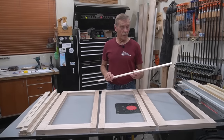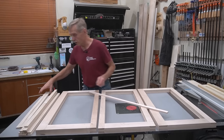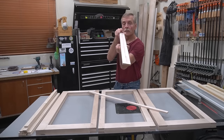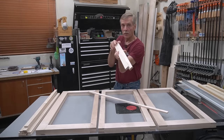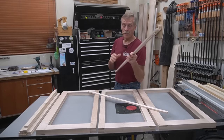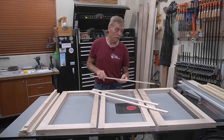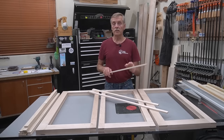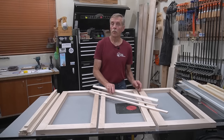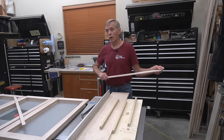These slats are the exact same width and thickness but have a little bit of a bow in them. I don't want to program the laser to follow the curvature, so I'm going to create a fixture to hold these slats perfectly straight so everything comes out consistent when I burn those mortises. As with any good fixture, this one will serve more than one purpose: holding the slats straight, orienting them at 90 degrees to the gantry inside the laser, and providing an alignment function.